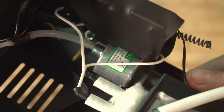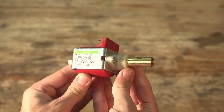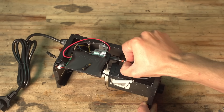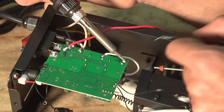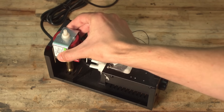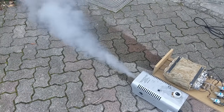The amount of smoke being produced basically boils down to this: it's all about how much glycerin and propylene glycol you can evaporate per second, and this depends on the pump's flow rate. These small machines use puny 15 watt pumps, so they're not really able to force that much liquid through the heating block. Wouldn't it be nice if we could replace that tiny pump with a much beefier one? I salvaged a 48 watt vibration pump from an old espresso machine — you can also buy them brand new for fairly cheap. These are perfect for fog machines as they are able to reach pressures of up to 20 bar. I removed the old pump and unsoldered the connections from the controller board. The new pump is quite chonky and doesn't fit inside the machine, so I decided to remove the container and have the pump sit in its place.